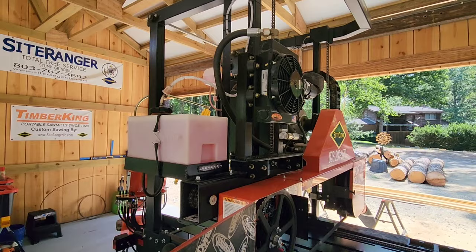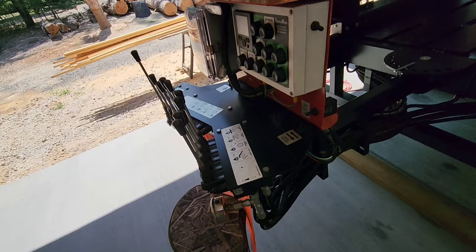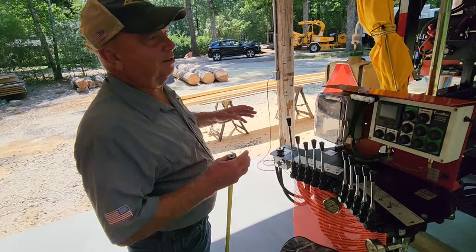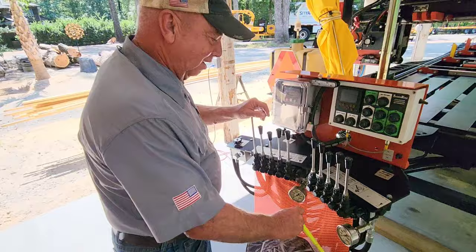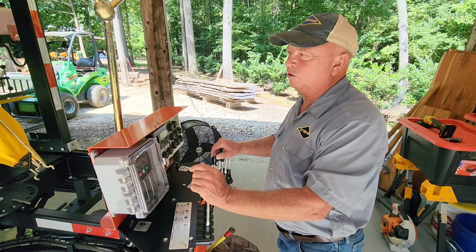It's got a thermostat set to 140 — it'll start on at 140. Or if I want to turn it on manually, I've got it wired in with a switch set up in parallel so I can do a little preemptive cooling. That manifold does get pretty hot. If you're running this sawmill and you put your hand on it, you know you've got hydraulic fluid flowing through either one of these manifolds, especially on the right side — you can definitely feel it.